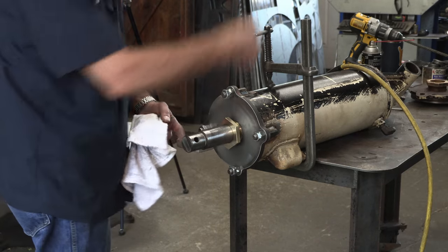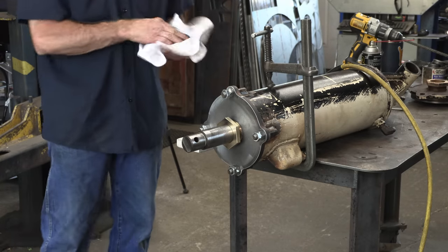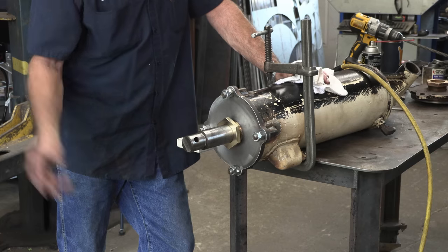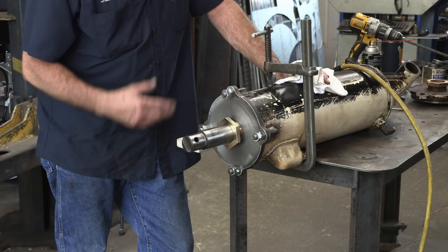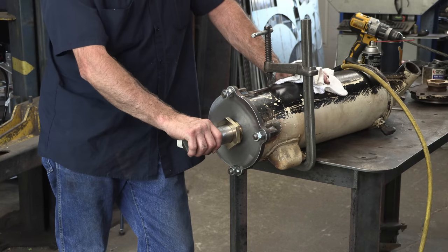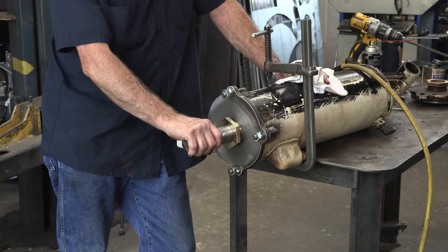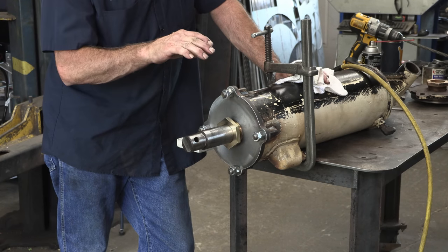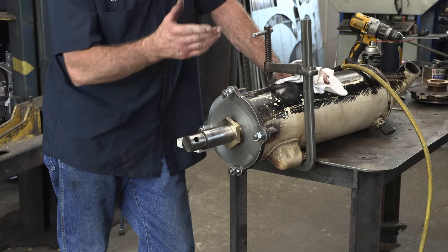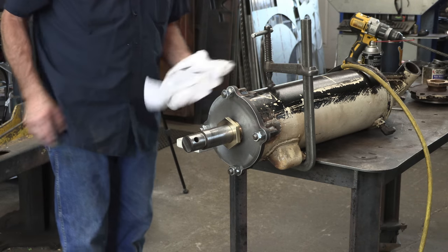This pin here can rotate wherever this fits in here. This is, more than likely, I think this is to lift a plow blade. This is this style cylinder I've seen on the front of plow trucks over the years. So it really wasn't described to me any other than it went onto a dump truck. But a lot of dump trucks around here also have plow blades. And with this being small cylinder packing here, low pressure cap, this is a pneumatic cylinder over a hydraulic cylinder.